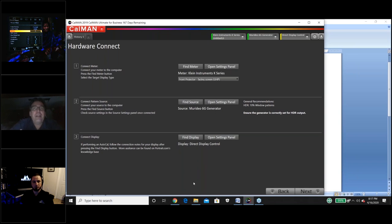In post-production, they are not doing any mastering or color correction or color timing on projectors. So what we're doing right now is using an application or Blu-ray or whatever source you're looking at, and applying it to something that's not close to 1,000 nits. In SDR, take your LG OLED, which gets to 650, 700 nits. So then we have roll off. The difference between the HDR mastering monitor and the LG OLED is we don't have quite as much light output, so we have tone mapping and roll off. But the problem with the projector is we're only at 1/4, 1/5 the light output of an OLED. So there's no reference point for HDR.